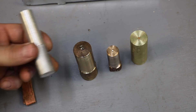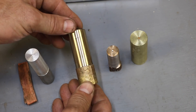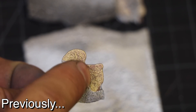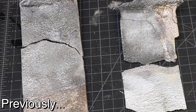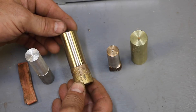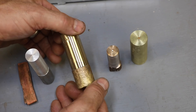If you're new here, my name's John, and we are gonna revisit the mixing molten metals experiment. This is a piece of copper, and this is aluminum. You mix those together, you get aluminum bronze. This is what we tried last time. I was trying to mix copper and aluminum in a molten state to get interesting alloy patterns in the casting. While I did get a small amount of this, most of it was fairly uninteresting looking, and it had a problem. This stuff is so brittle it is essentially not usable to me. We ended up with a lot of an alloy that was absolutely worthless and ruined the whole thing.